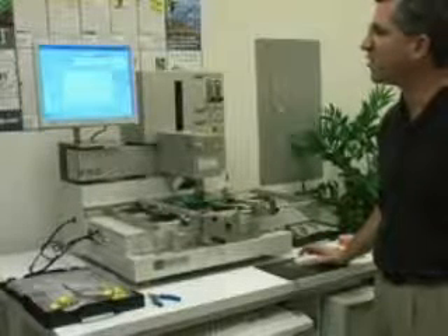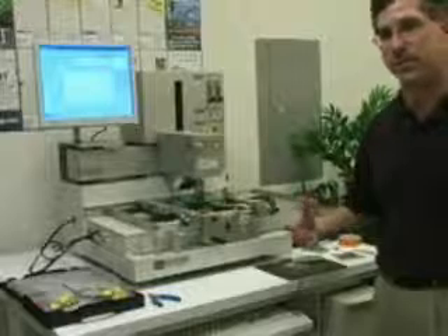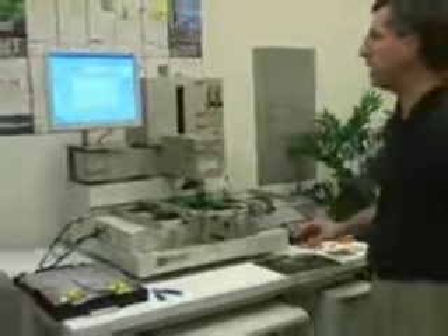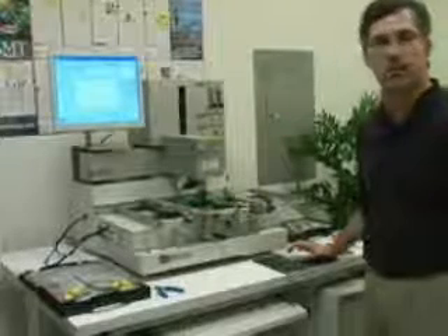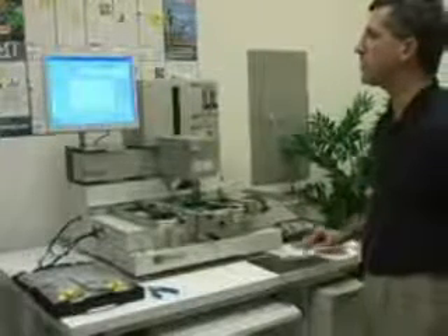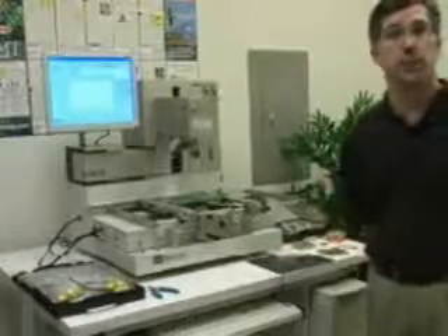As you see on the left here, we're going to go through each of the five zones of heating. That's simple — a very simple machine to use from an operator's perspective. The operator is only concerned about loading the board, aligning the part to the board, and selecting the proper program. The engineer could have recorded instructions — for example, don't forget to apply flux onto the site — to give a little bit more guidance to the operator. And at this point, we'll stop this to complete the demonstration.